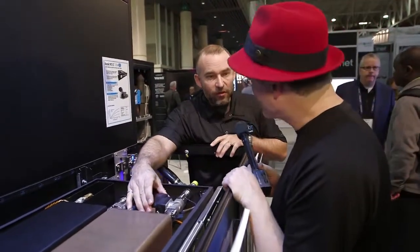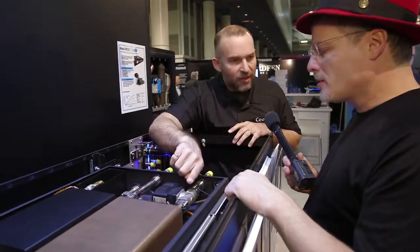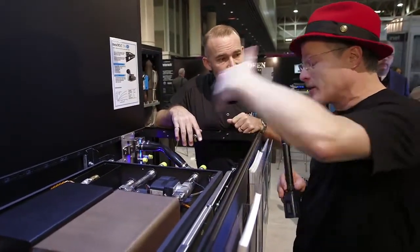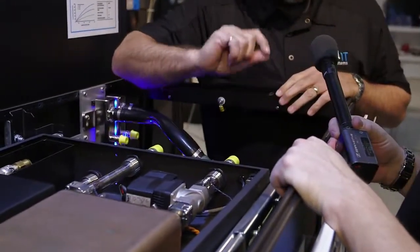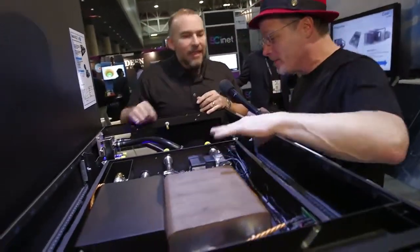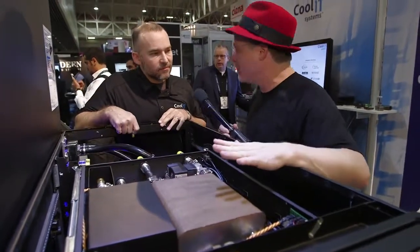This is a proportional valve that can go to a full stop. So if we end up having some sort of problem with facility water flow, we can shut it off right here at the first point as it comes in. It also acts as a proportional valve — if we're using chilled water, we want to make sure we don't allow the coolant to be over-cooled. To avoid condensation, we have a humidity sensor and temperature sensor here to calculate dew point, and we limit the flow of chilled water so we never get down below dew point. We don't want condensation happening inside servers.